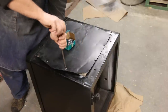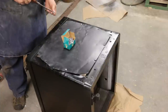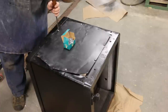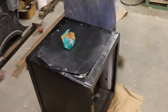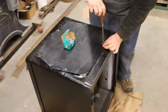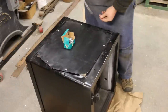I'm going crossways — using the original holes but I want to make sure they all line up, so I'm working my way around kind of like tightening lug nuts on a tire: don't start in one place, move around a little bit. I'm not tightening them all the way down right now because there's some flex in this from the bending and beating on it, and the holes may not all line up exactly. Hopefully everything is going to tighten up just fine.